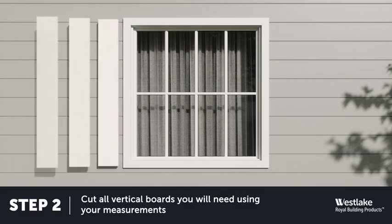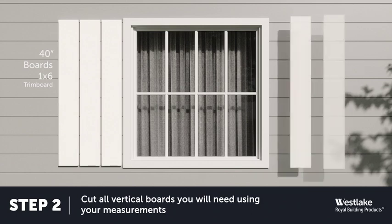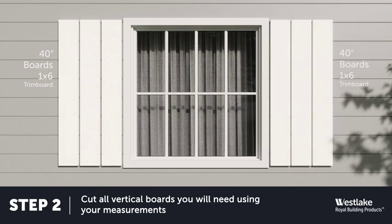First, make the vertical boards of your shutters. For each shutter, cut 3 1x6 Royal PVC trim boards to the height of the window using your measurements. It's a good idea to cut all of the pieces you'll need for all windows at the same time.